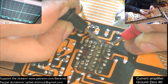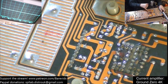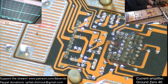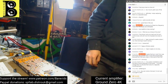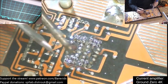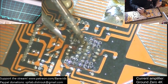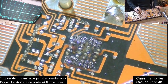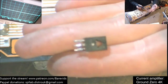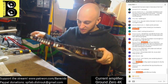I'm curious whether the drive circuit got killed this time - it doesn't always get killed, depends how the FETs blow. Checking for obvious shorts on the driver transistors - we've got 76 ohms between one and three, that's not right. These need replacing. I need to be careful because this area of the board is obviously quite badly damaged, and any heat I add with my soldering iron won't help. I'm removing solder from the holes first - this one has a nice big bulge in it. This is a mess.